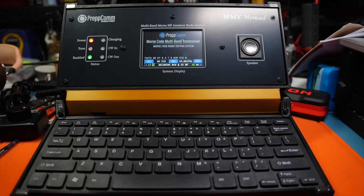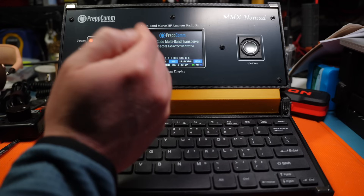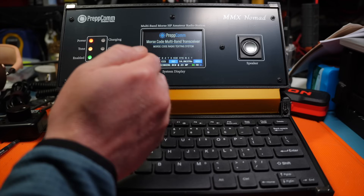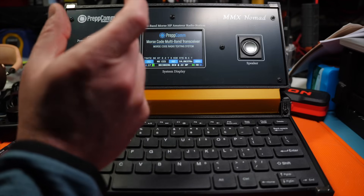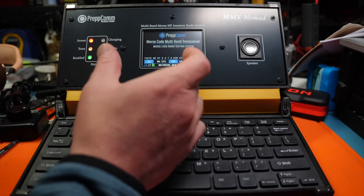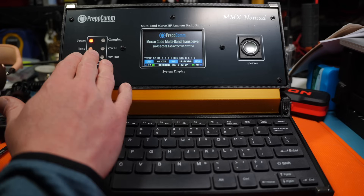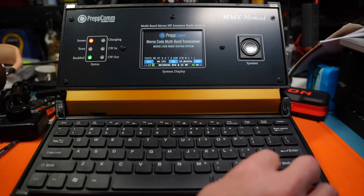When you do CW, people aren't always going to be on the perfect frequency you're listening to — they might be off a little bit up or down. This device really wants to know exactly the 1,300 Hz tone of that CW. That's the exact Hz range it's looking for for the decoded signal. Somebody's close, but we're not getting them. That's a loud signal, but we're losing them.